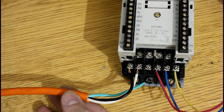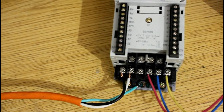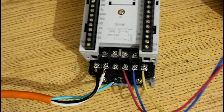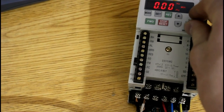Now the input is 60 hertz alternating current, and the output is whatever we want. So the input gets rectified into direct current, and then it gets switched out as alternating current with a different frequency. So if we start them up, you can see what it does.